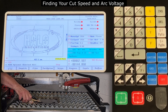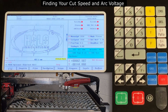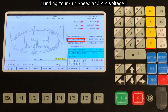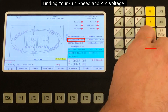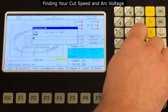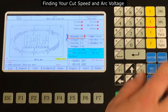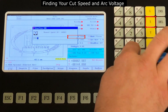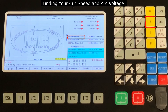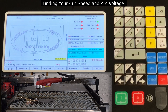I am going to make an adjustment to the cut speed and perform another manual test cut. I like to adjust both program speed and manual traverse speeds at the same time. I will use the F button to access the program cut speeds and the X button to access the manual traverse speeds. If you have lifted the Z-axis between test cuts, be sure to press number 6 to run the IHS test to reset the arc height.